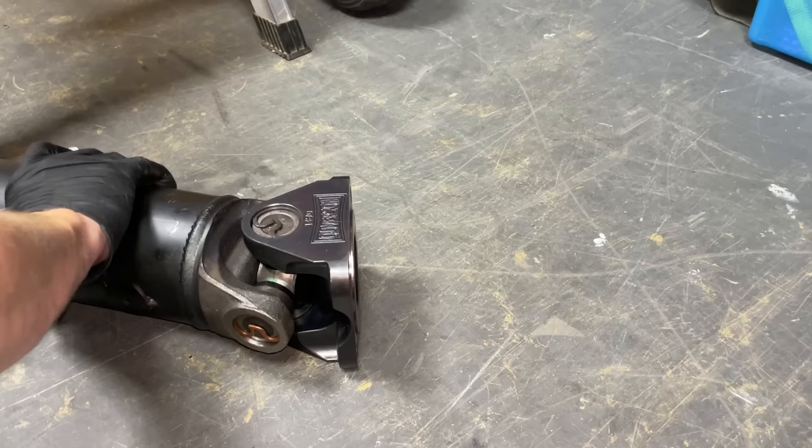On a monster truck, you have to wire it up so that you can only start it when you're in neutral or in park. So we've got this little sensor here that we've got to fit in. There's a little ball valve on there, look. And these little rollers just sort of push onto it, and that will break the circuit to the starter motor so that it doesn't start, I think. I don't know. Probably got it wrong.